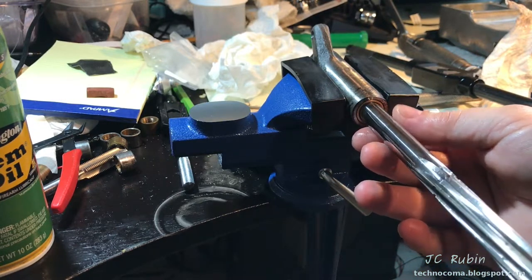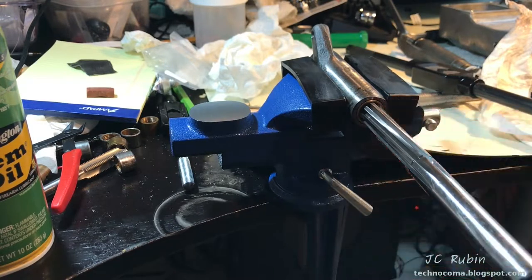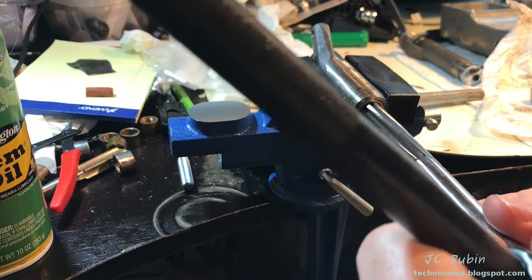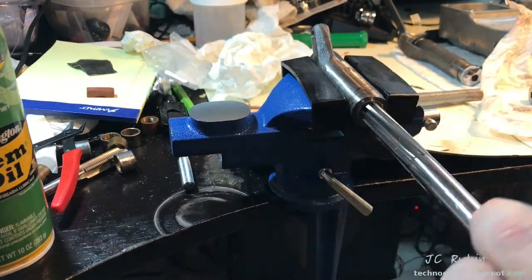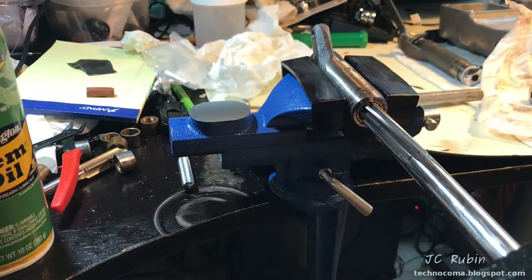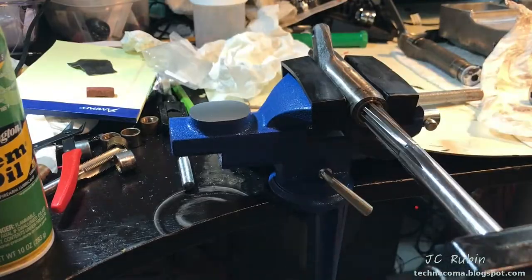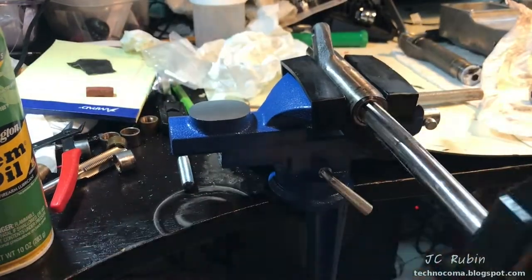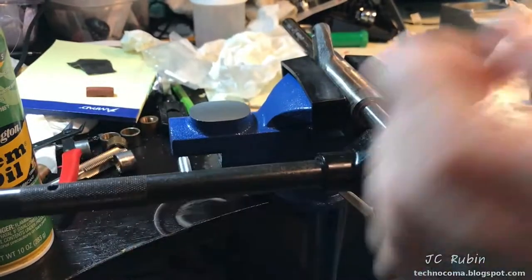I'll demonstrate this procedure on one rocker. The rocker has been cleaned out, the reamer has been cleaned, and everything lightly oiled. As I put the reamer in, I'm always applying just a little bit of force clockwise — the reamer is never turned counterclockwise. Turning it with very light inward force, it kind of pulls itself in. It cuts as it goes; in the middle there's an area of slight resistance as it reaches the other bushing on the other side.